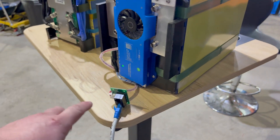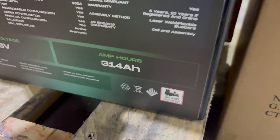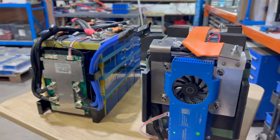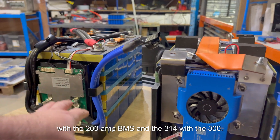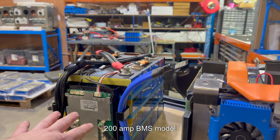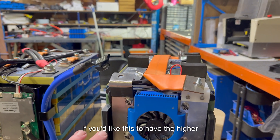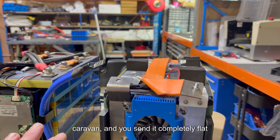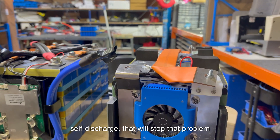If you add more batteries, they just stack — plug one to the next to the next. You can see a completed unit here with a little CAN port down the side. Both models are in stock: the 300 with a 200 amp BMS, and the 314 with the 300 amp BMS. If you'd like the 200 amp BMS model set up as 314 with the lower voltage cutoff, that's absolutely possible — and same the other way. The higher cutoff is mainly useful if the battery is in a caravan and gets sent completely flat, then ignored for three months — it prevents the cells from getting dangerously low due to self-discharge.